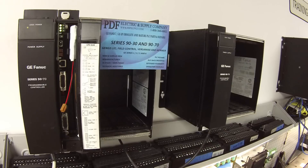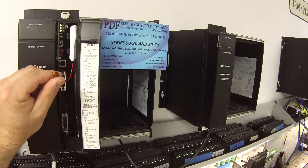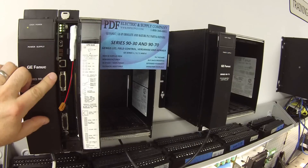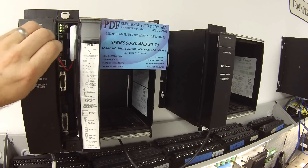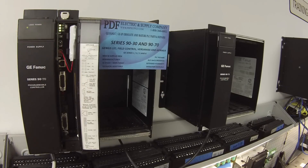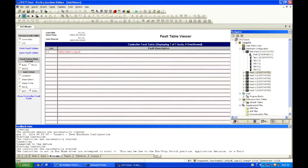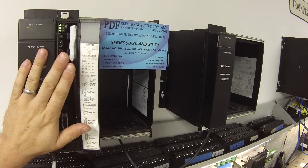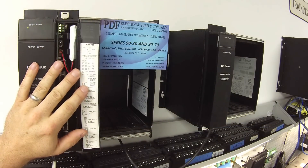That's the two battery connector. A couple of things about troubleshooting to see if it's bad — the 9070 series doesn't have a light that tells you that the battery is dead or disconnected. What you want to do is go to your Proficy Machine Edition, go to your top menu bar under Target, select Diagnostics towards the bottom, and your fault table viewer will pop up. If there's a failed battery signal, meaning the battery is either disconnected or dead, it'll tell you that in the fault table. That's one way to test if it's operational before you unplug or power down your CPU.